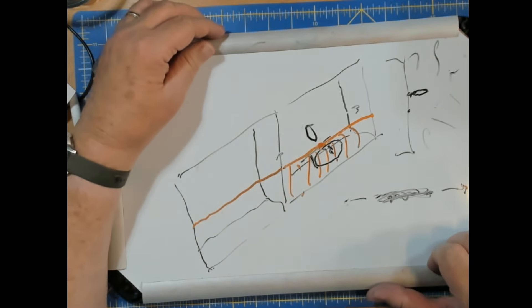You've got to be near it in order to tune it. The tuning on these antennas is such that the variation in temperature between morning and afternoon can be enough that if it was tuned in the morning, it won't be in the afternoon — you'll have to retune it. Not by much, but you will have to retune it. So you can't just leave it on your favorite frequency. The way you tune one of these things is to tune for max noise. There is a tuning aid available from DX Engineering — a little thing you clip on. You can also get that from Chameleon with the F-loop. When that thing lights up while you're transmitting, you're in the right place.